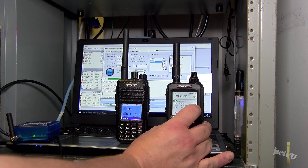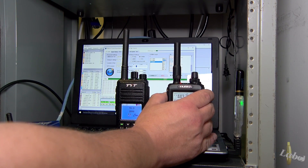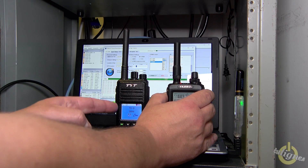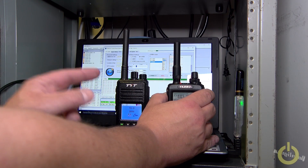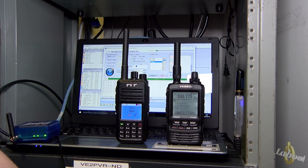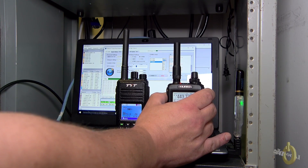So what I'm going to do is trigger it here in voice-wide and see what it does. It goes through and transmits VA2PV, but unfortunately you will not hear any audio on the DMR radio since it's probably on the other side — it's about 25 kilohertz off. So if I put it back in digital narrow, it will go through VA2PV.